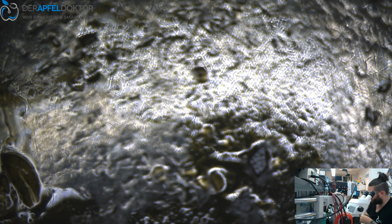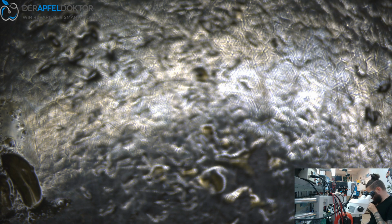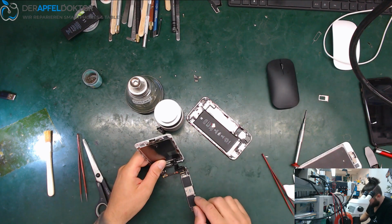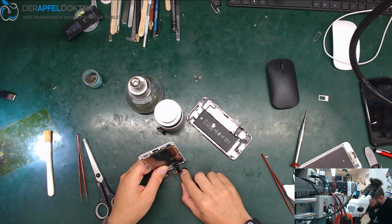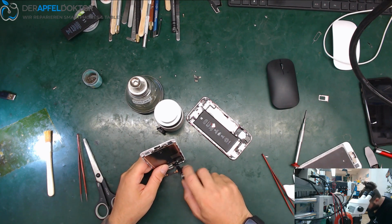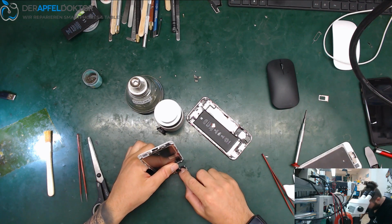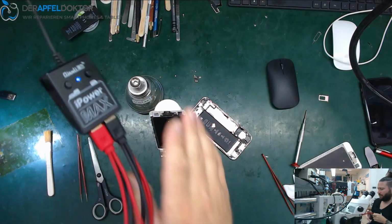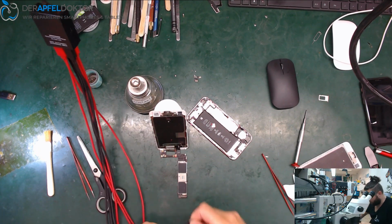What about the connectors? Oh, we take another screen. One moment. So we take that 6S screen and get it hooked on. Okay. So hook it on to the FPC. It's a 6S, it's okay. Just had to take a look. Okay, connect the home button. And now we can just see if our short has gone.